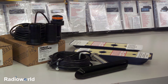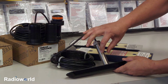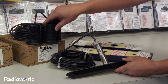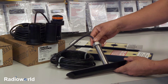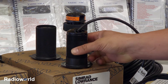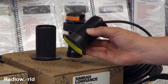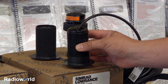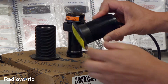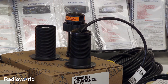These transducers here are through-hull transducers. You're going to have a shaft, and a hole will have to be drilled based on the diameter of it through the hull. The transducer is fed up through and a nut goes down holding it in place, and obviously you'd seal it up correctly. This is one of the most common styles for through-hull mounting — it's called a flange mount transducer. This particular one is an Airmar P319. It requires a two-inch hole to feed it up through the hull. This is what would be sticking below the hull, your hull would be right here, the nut comes down and tightens it into place.